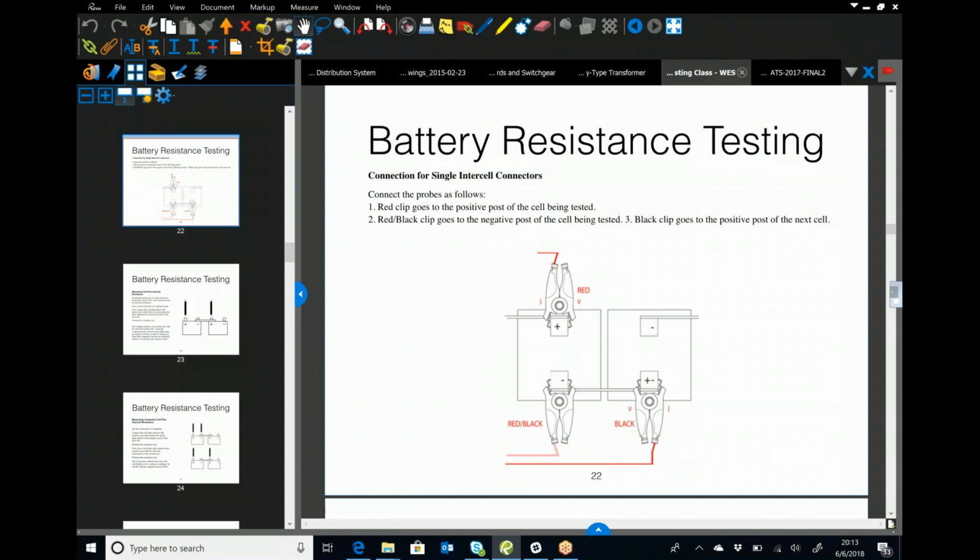And so torquing, you do need to suit up to whatever cal you need to when you're doing torquing. And you've got to use insulated tools. I mean, you get into some of these cabinets and it's extremely tight. Joey's seen some of the UPS cabinets and worked on some of those. It's a different animal.